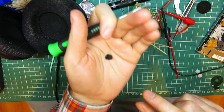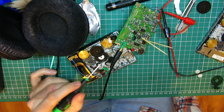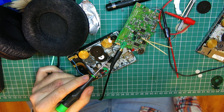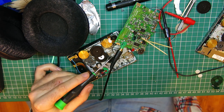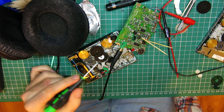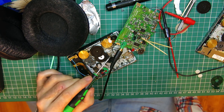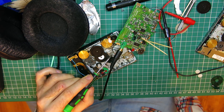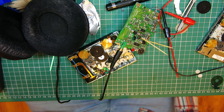these little tape spindles. And what I had to do in the end was take that gear out of the spares unit, put it in a drill vise, get a rubber mallet and a steel punch, and knock it out. It was terrifying, this tiny little plastic gear. I had to use some force to get it out. And then I've put that gear on another spare spindle, put the spring back in and everything, and done a tiny bit of glue on top. I let that set, and this now goes round fine. So I put the belt back on,